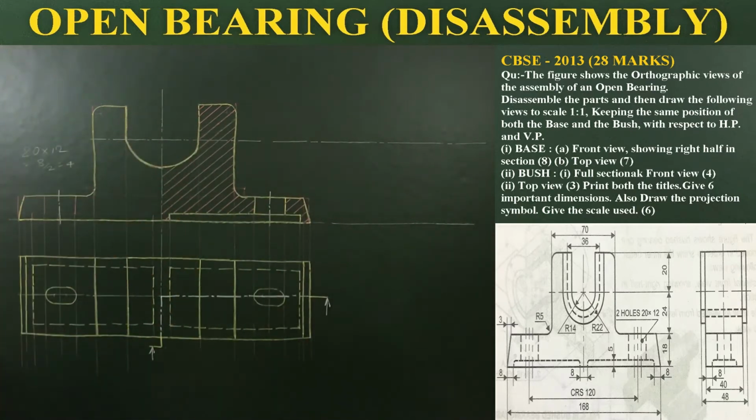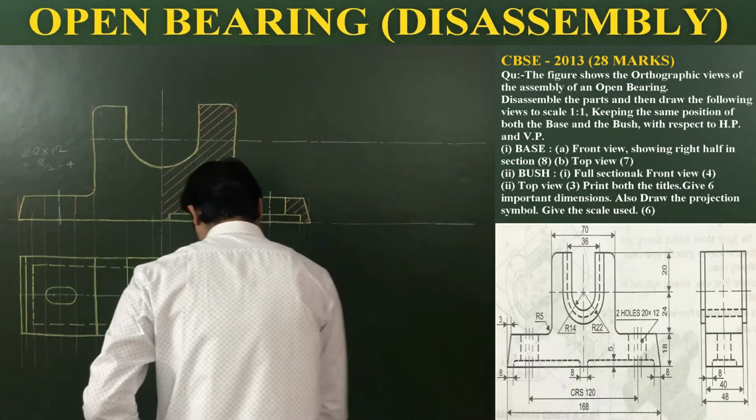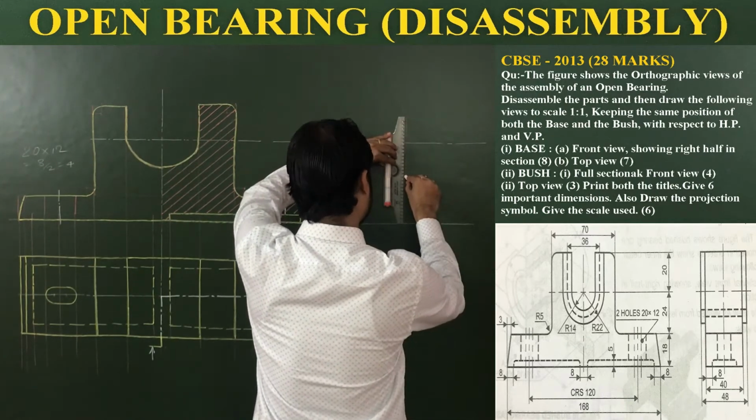So from the assembled view, it is clear that from the front, the dimensions of the bush are: internal radius is 14, external radius is 22, and for the middle portion, totally it is 36, so radius is 18. Now from this point again, we'll draw one more center line,